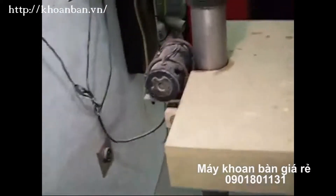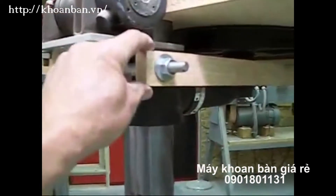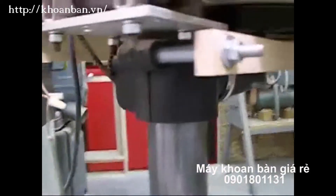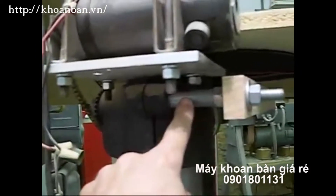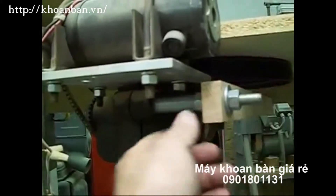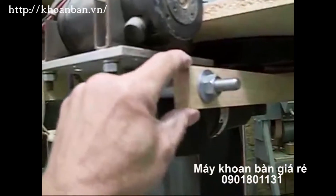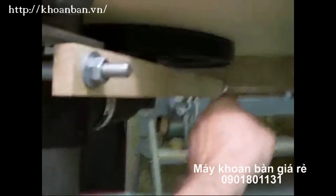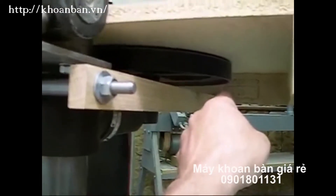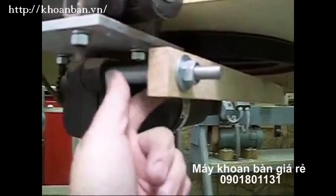It took me a while — chiseling out the captured nut took longer than anything else. It's kind of finicky. This is a two-inch piece of EMT tubing here. You've got to adjust it just right and tighten it just enough so that the table is loose, drill your hole in the board, then slide it up to where it's tight up above at the front of the table. Push the board in and then reach back in with a pencil and mark where that nut is.